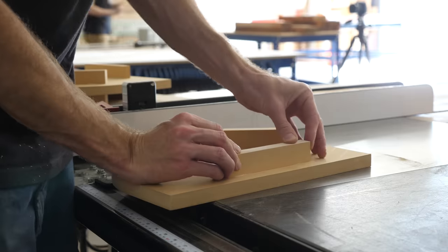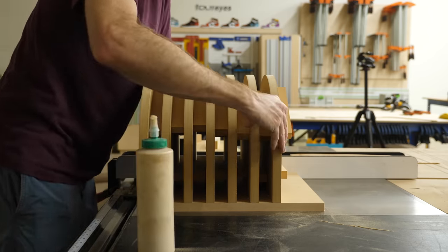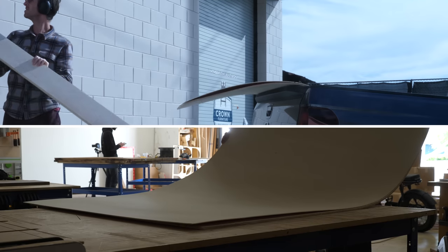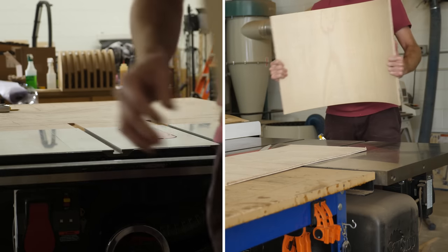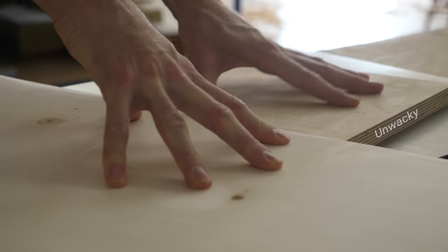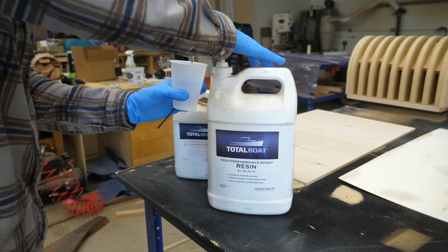The first thing we need to do to make a curved piece of furniture is to actually make a curve. And to do that, we need a couple things. I used flexible plywood — sometimes called bendy ply or wiggle wood, or wacky wood — which are perfectly accurate and needlessly hilarious names. Whatever you want to call it, I layered it up to match some three-quarter inch Baltic birch plywood, the unwacky kind, which would be used for the flat sections. And I made a bending form out of MDF.